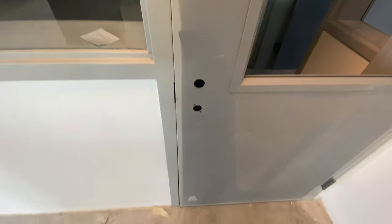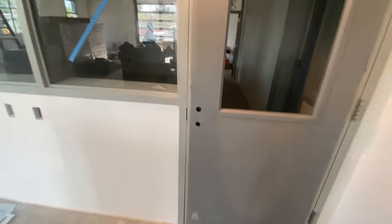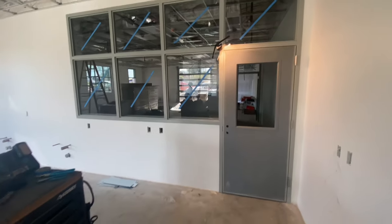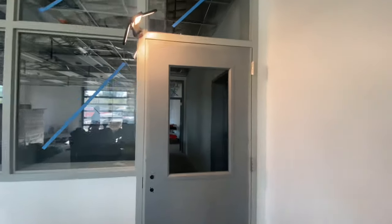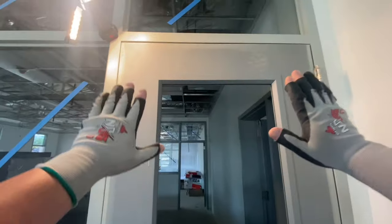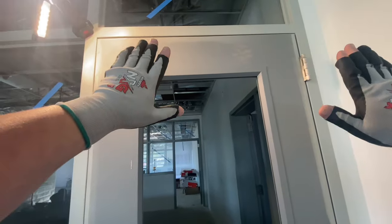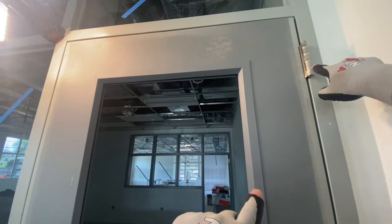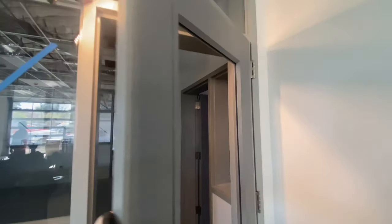You can see this door needs some major adjustment — it's hitting the latch leg at the head, and down at the bottom there's a gap. Up top it was so tight that it's actually hitting the leg and not operating smoothly. I need to pull this door back away from that latch leg. I've got a pretty big gap on the hinge side that I need to close up, and closing that up is going to give me more room on the latch side.